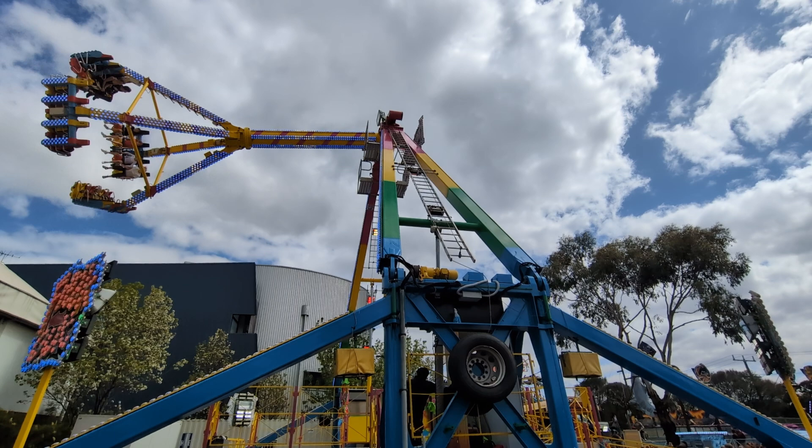This ride, on the other hand, has a really narrow A-frame which is much more inefficient at being in tension and compression, allowing the whole structure to bend. Have a look at this footage and look how much it moves. As an engineer, it's a bit horrifying to go to carnivals and watch rides like this, whereas the previous one was fine.